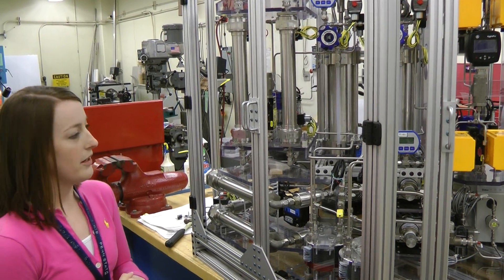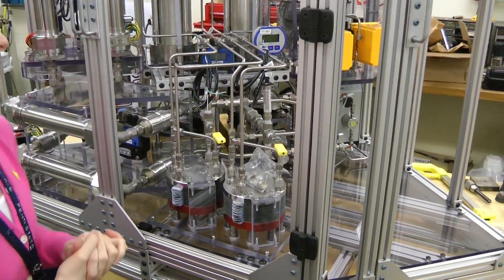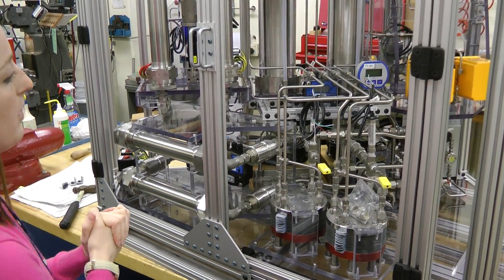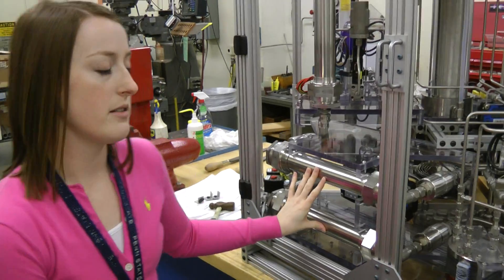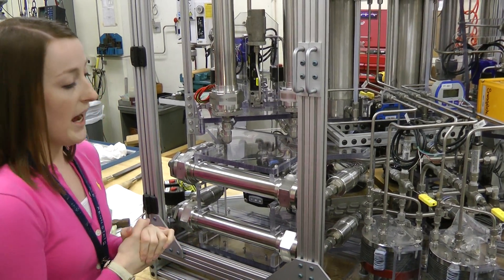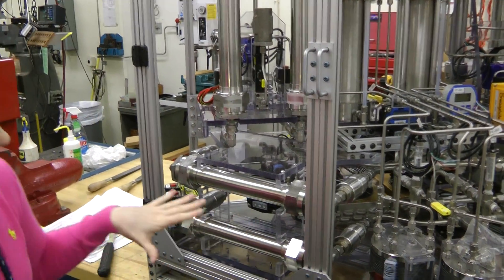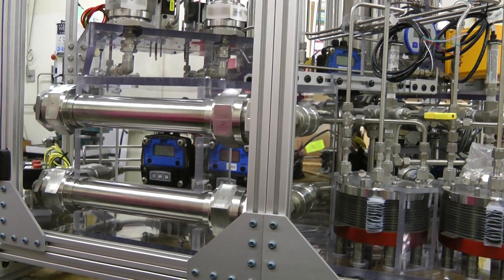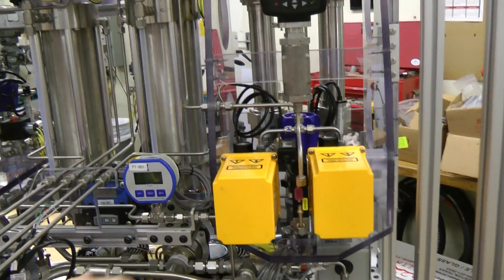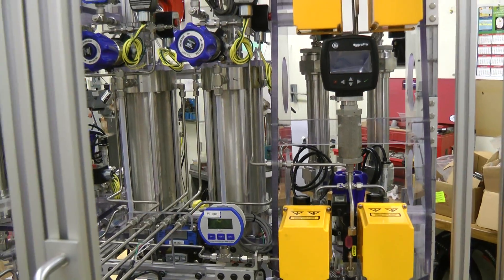I can walk you through the large components so you get an understanding of it. These are the electrolysis stacks — we have two of them. They are each 12-cell proton exchange membrane, and we're using them in the liquid anode feed configuration rather than cathode feed. We have all of the components needed for the water management system. We have deionization beds that are used to keep the water quality at what's required for the electrolysis stacks — the water must be a certain resistivity so that we're not conducting electricity anywhere other than right at the electrolysis stacks. We have flow meters and different instrumentation to make sure everything is going the way it's supposed to. We also have pumps to move the water at the required flow rate needed for the electrolysis stacks, to ensure water coverage across the cells and that the cell membranes aren't drying out.